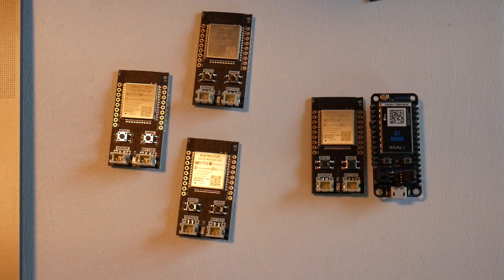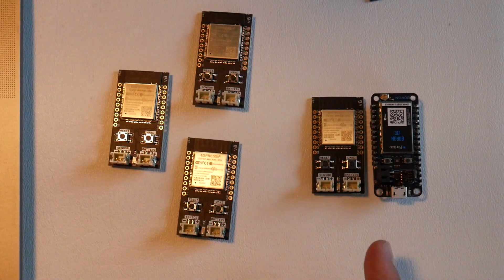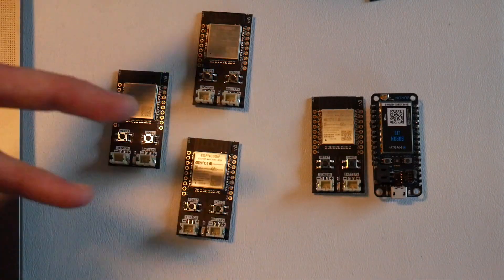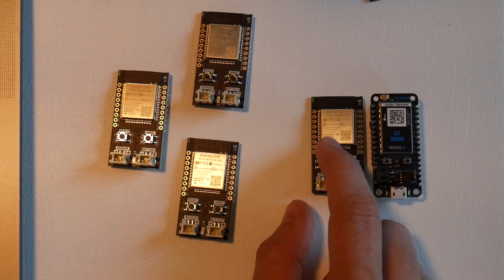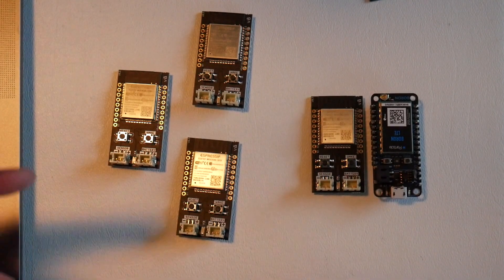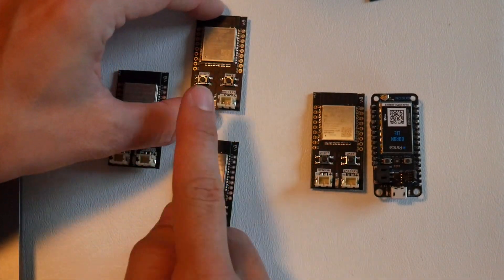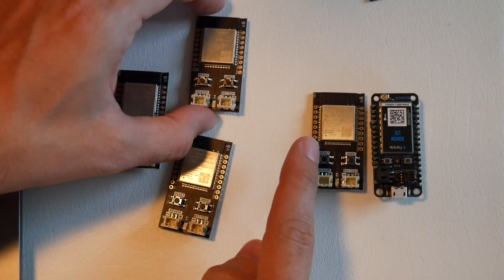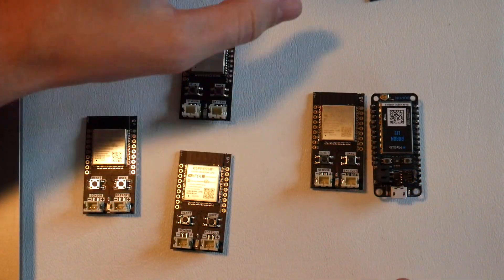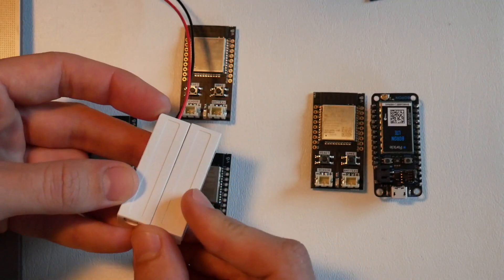Because it's cellular-backed, it does not rely on any internet access or existing Wi-Fi. We're going to make the access point hidden — that's built into the code. It can be named anything you want; I like to give it some random character string so even if somebody can sniff it out, it won't mean anything. These trig boards are not always connected to the access point — the trig board is completely dormant, just listening for that normally-open or normally-closed contact to change states.